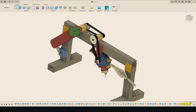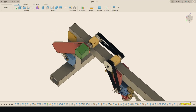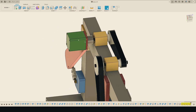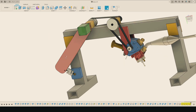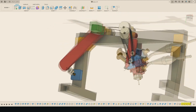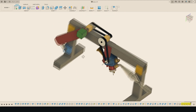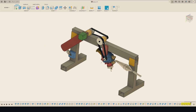And a jackshaft with gear reduction, belt drive, then a bearing block here with another jackshaft connected to that hydraulic pump, a torque arm here, and a load cell there. Now this is not the final design and there will most likely be a lot of changes along the way, but this is the basic idea.